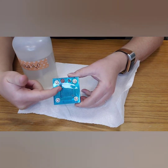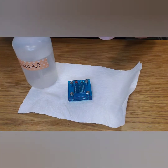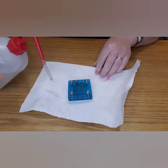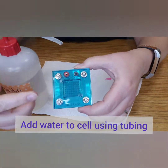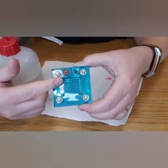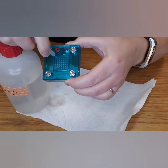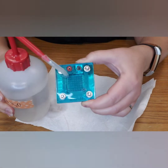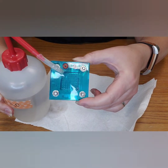There are two ports on the outside of your fuel cell. You will need to attach the tubing from your distilled water bottle to one of the ports on the outside — on the oxygen side of the fuel cell. That is the red labeled, positive side. You only need to hydrate, or put distilled water into, the oxygen side of your fuel cell.